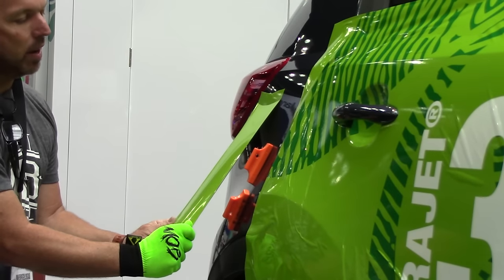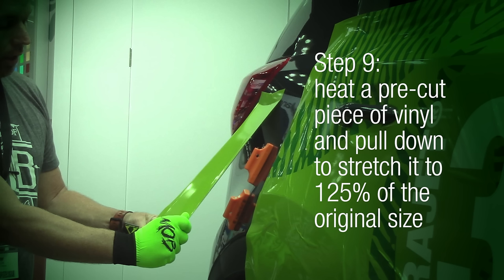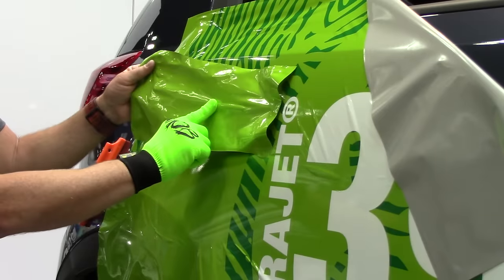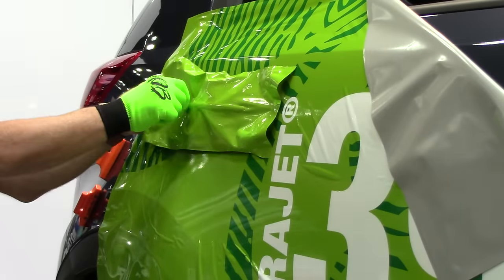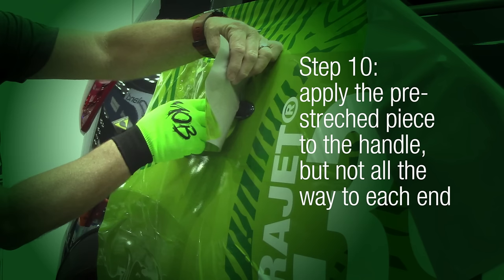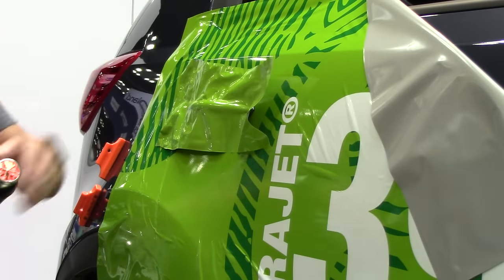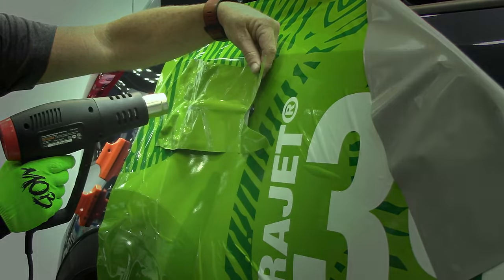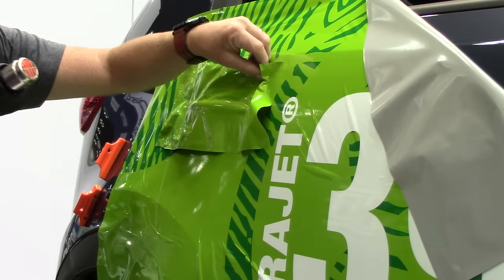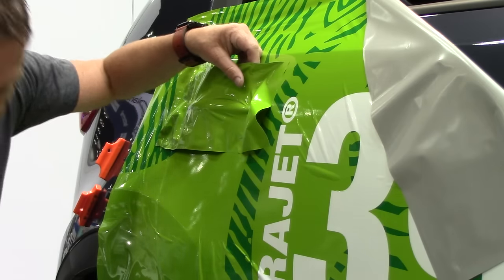Then for the handle itself, we use a pre-stretch technique. There are a couple of different ones. This one I use is just a normal pre-stretch where I put a piece of vinyl at the top and stretch it down with a little heat. Let it cool down, then I put a ridge right across the top of the handle and heat it down and let the outside edge of the vinyl just shrink back down. This keeps little fingers from popping up around the outside edges, and the outside edge of the vinyl is completely not stretched and stress free.